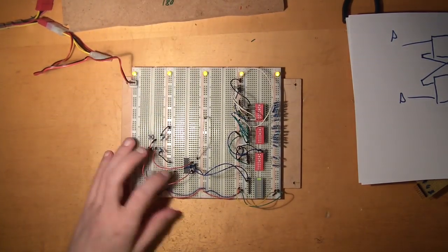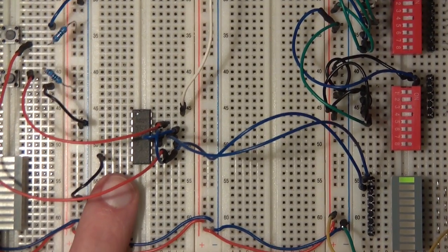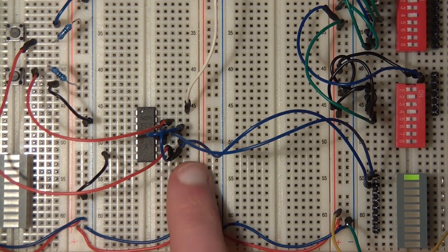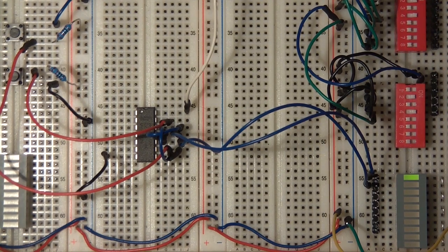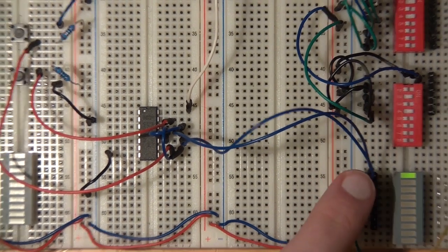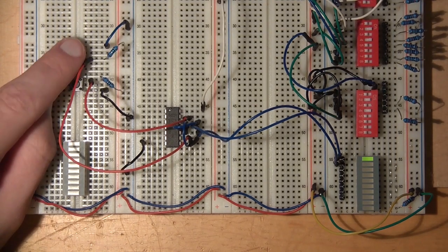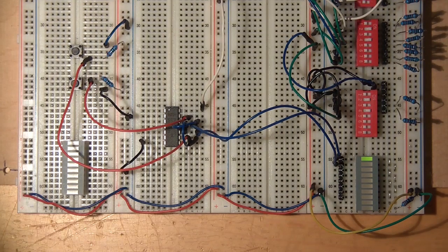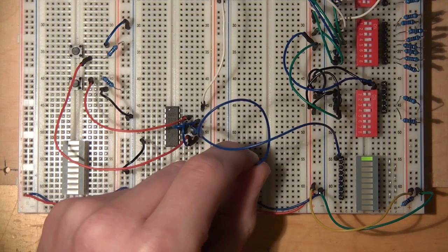So this right here is the circuit I just drew — four NOT-AND gates, and two NOT-AND gates are connected across. We have two buttons and over here we have our output. You can see that the first and the second LED always have opposite states — exactly like I said: the first output is our actual output and the second is the output inverted. Let's ignore the second output altogether, because then it becomes much clearer what this circuit actually does.